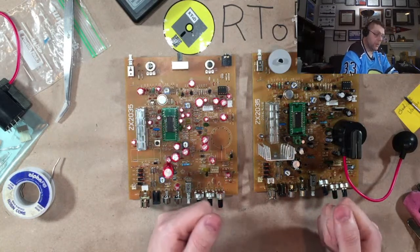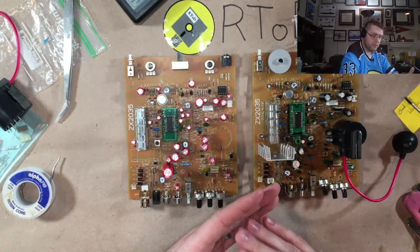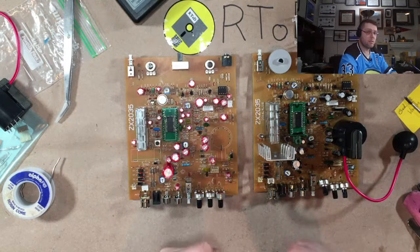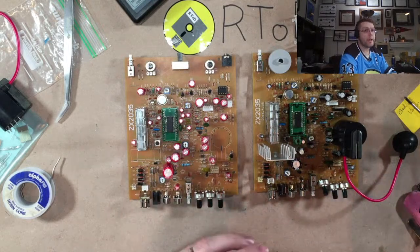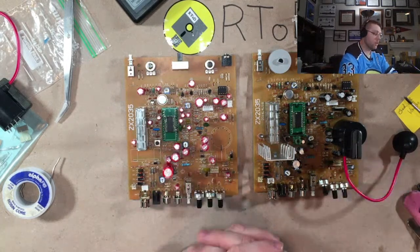The problem with that is, and we're going to see this in part two, I did film this already, I had four or five different resistors, all of the same value, or should have been of the same value, and one after another, I would measure them, and they would be way off, just way off. One of them was way, way out of spec, but you wouldn't know, because you would just look at the bands and install it.